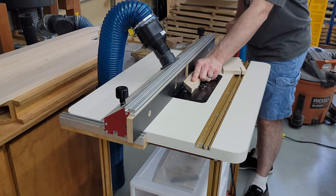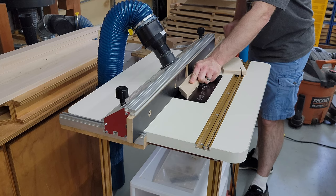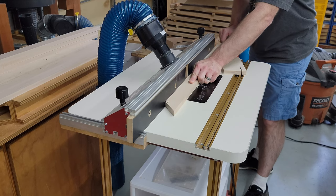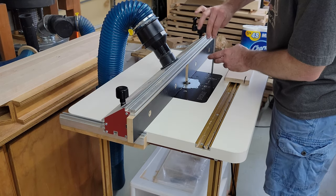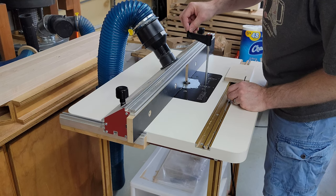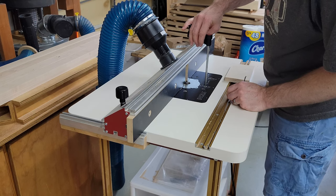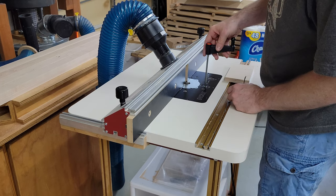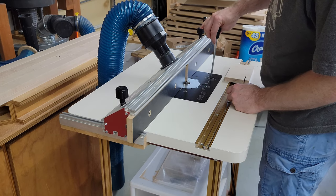When I say that this was hard maple, I'm referring not only generically to the species, but also to the fact that this was some seriously hard maple. I was taking light passes to safely work my way up to the final depth, but no matter how shallow of a cut I took, I was still getting some tear out in certain parts of the top edge. Most of the boards were fine, but a couple chipped out enough during the slow, shallow final cut that I decided to go just a little bit deeper and make a couple passes going the wrong direction along the fence.